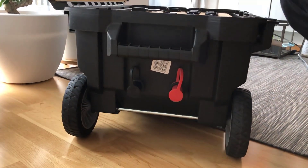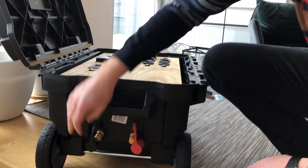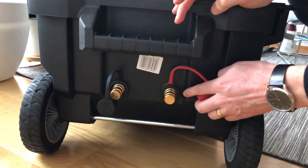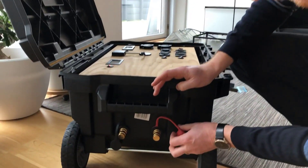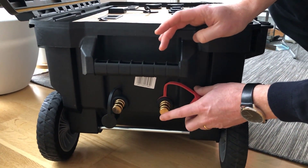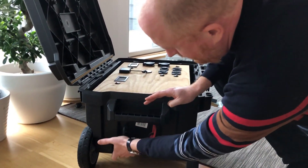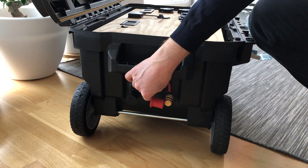For me it's mostly for fun, but it's a cool add-on. These are called power studs and they are basically two gigantic brass connectors. They're an external connection directly to the battery — well, not directly, they go through a switch which we'll look at later. This is a way to get power out from the box from the outside, or in if you wish, so you can connect it to external batteries. These particular products were bought from a site that normally sells car parts.